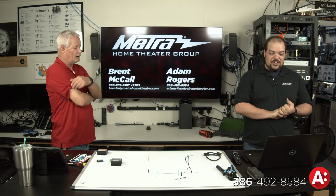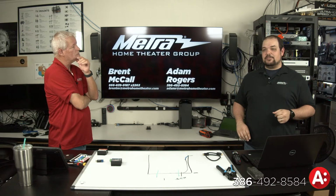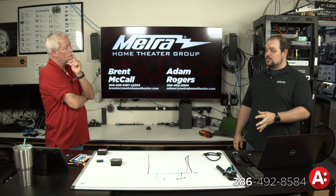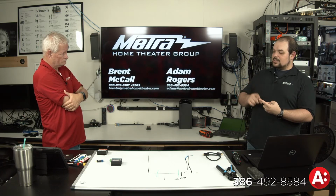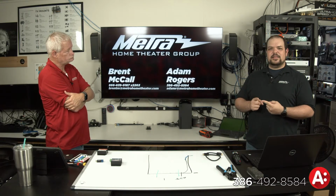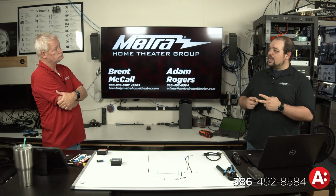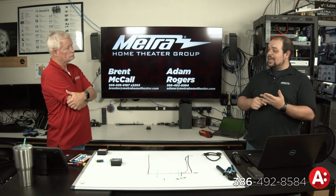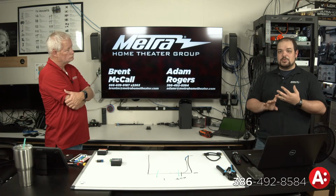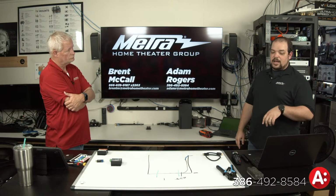Now, the experts are saying most camera testers have an HDMI input. You are correct. If you have one of the testers that's meant for surveillance installations that has a BNC input or even SDI, most of those have an HDMI input as well as a LAN connection, so you can do ONVIF testing. So definitely take a look for those as well.